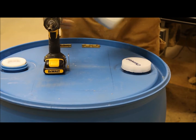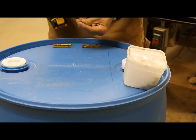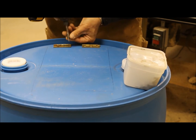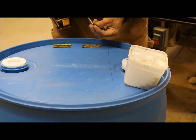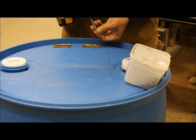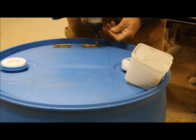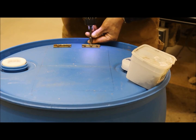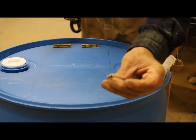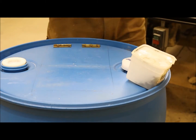The reason I'm doing it this way is I'm getting all the screw holes already pierced through and lined up, so that once I cut the barrel lid out, I'll just reinstall the hinge and everything will be aligned. That's a really good tip on how to make your lid line up again. These zip screws have a hex head on them, which gives you a good grip, and I just use a hex head bit for that.